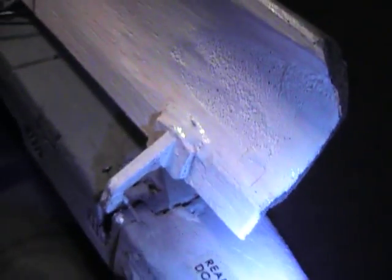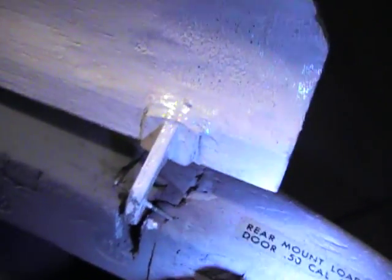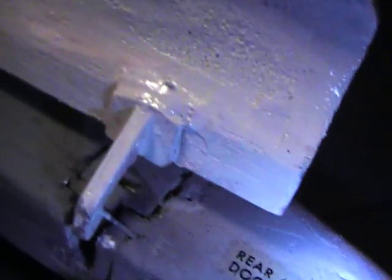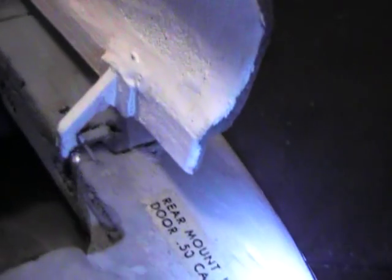The Sonic-tronic hinges here, you'll see, is an old set that I used to have. We used to be able to get those that were spring-loaded. You can't get these anymore, which is kind of irritating. You can get the normal ones that aren't spring-loaded, shop around and find them, but they used to have a little spring load on them. And I made some springs just by coiling up some music wire, and it goes on the hinge. You'll see the little pin right here I've got in behind it, so that when it comes up, it actually hits the pin instead of like the LX that has the hinge sticking out, so it rides up against the hinge. Mine, actually, you'll see it runs right there against the hinge.